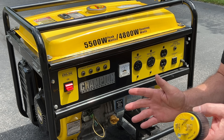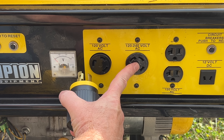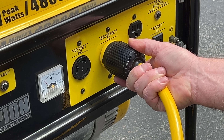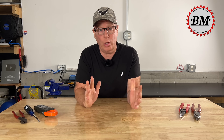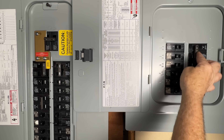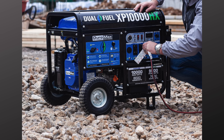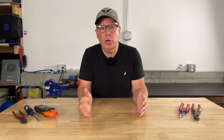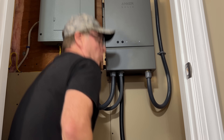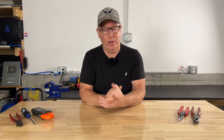If you don't have one already, you're going to need a generator and a connection cable. If you're shopping for a generator, you're going to want one with an L14-30 receptacle — this is a 120/240-volt 30-amp twist-lock receptacle. I would also recommend at least 4,500 running watts or larger. My generator is 4,800 running watts and it does work fine for us, but I do stage my breakers to reduce starting watts and voltage fluctuations. If I had it to do over, I'd probably buy something a little larger. I'll list a few good backup generators down in the description. I also just installed a 6,000-watt automatic battery backup system for the house — I'll be posting that video on August 12th.